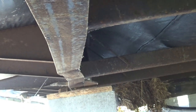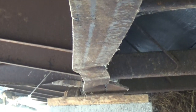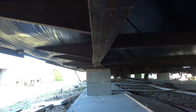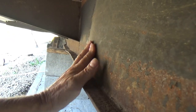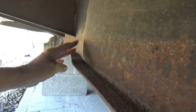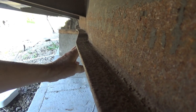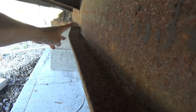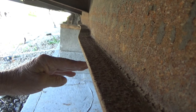Crawling under here — we'll see more of it if I get the dirt that's lodged in those axles off; we'll be able to follow this frame rail down. Right here right where I'm pointing is a swollen area where the frame is buckled, and if you look underneath you'll see it there. Here's the worst of this bulge on this side here. I think we're seeing it on the camera. I'm going to try to pull this over that way some and pull it down at the same time.